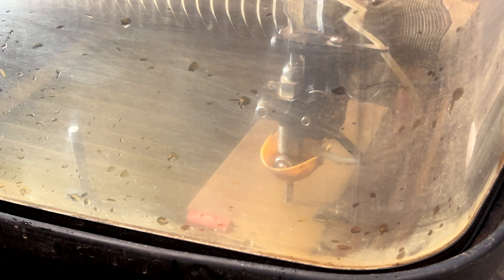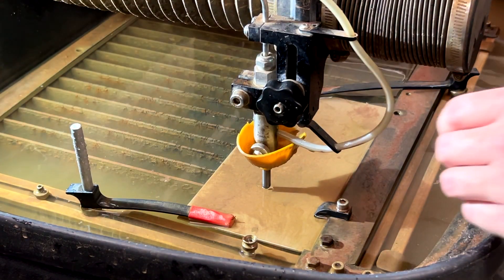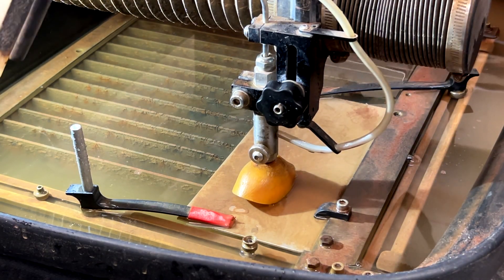Press Home for the X and for the Y. Press Begin Machining and it will pop up with Path Control. You can left-click the Start button — it might be a little spooky — or right-click the Start button and dry run at full speed, half speed, or quarter speed. The final thing we do before running the machine is make sure the nozzle cover is closed. Cover it down, and then we're ready to run our piece.